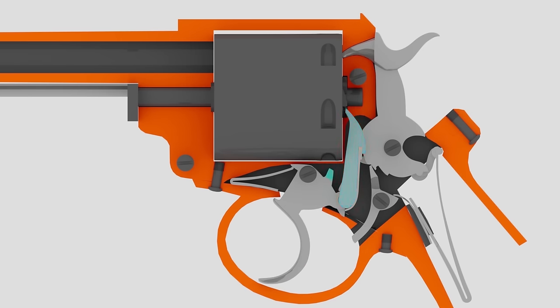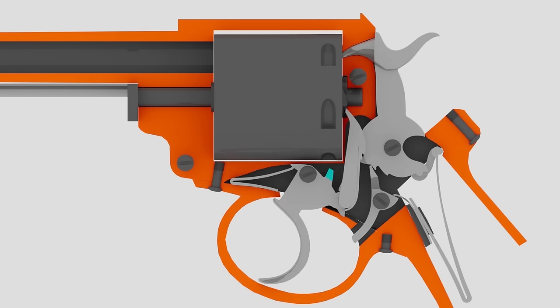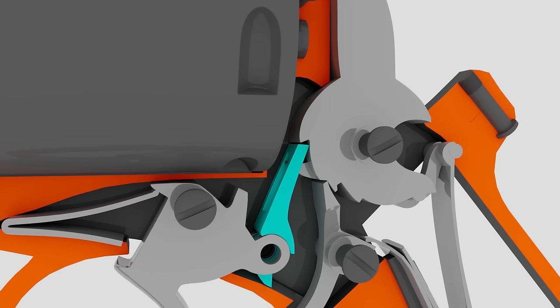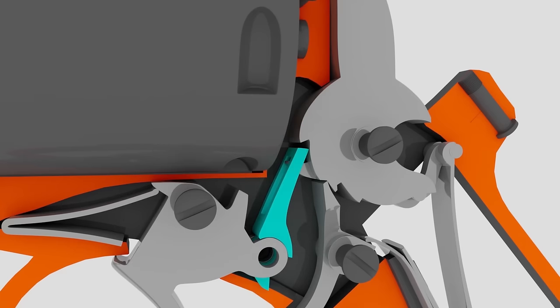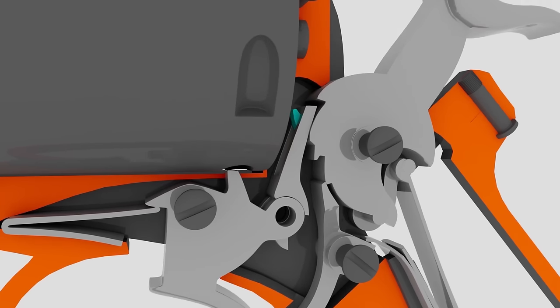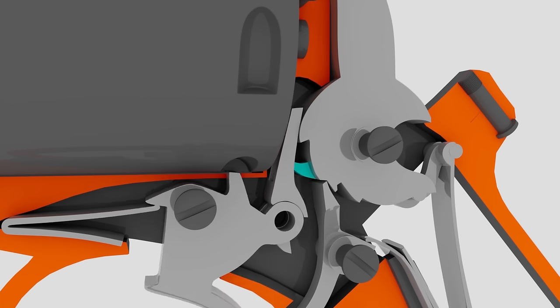Over-rotation is prevented by the cylinder stop, a projection off the top of the trigger, which rises into place as the trigger is pulled or dragged along by the hammer. Also attached to the trigger is this strut. It's held in place by the hand's pin and shares its flat spring, though in this case it's biased to the rear into the hammer's breast. Pulling the trigger shoves the strut into the hammer, where it catches on a notch and shoves the hammer way back before slipping free and allowing the hammer to fall. A hole in the strut meets with a hook on the hammer's breast. When manually cocked for single action operation, the hammer drags the strut along. This in turn brings the trigger, hand, and stop into their correct positions. When the trigger is pulled, the strut clears the hammer just as the sear is depressed.